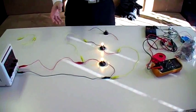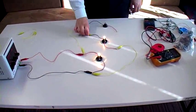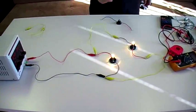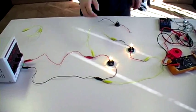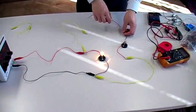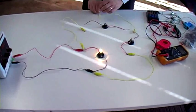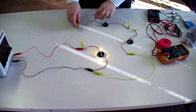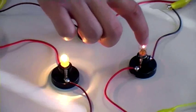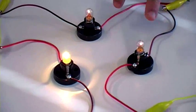What if we combine elements of parallel and series circuits together? Here I've set up a parallel circuit with two light bulbs — equal brightness, each drawing about 0.24 amps and getting 6 volts from the power supply. Now if I add another light bulb to this circuit — one in parallel and these two in series with each other — notice the brightness is very different. These two are much less bright.